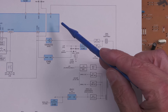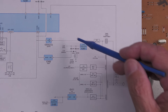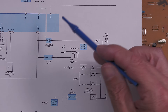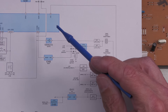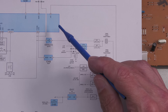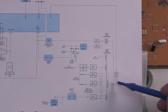The system controller IC activates the relay on power-up. It looks like I'm getting the standby signal to activate the relay because I'm getting all these supplies, but I think the system controller IC is not finishing its self-checks because something else is wrong. That's why we're getting nothing on the display and the standby light stays on, even though technically the relay is turned on and the main transformer has power.